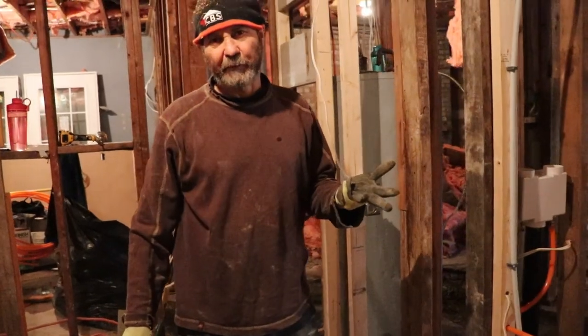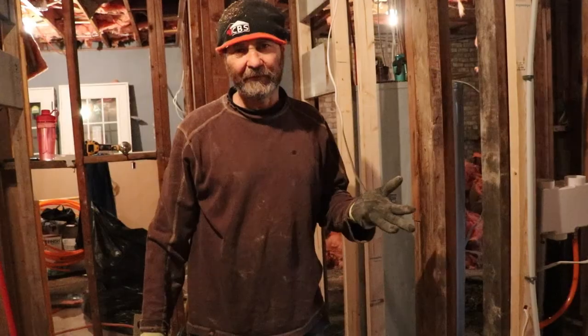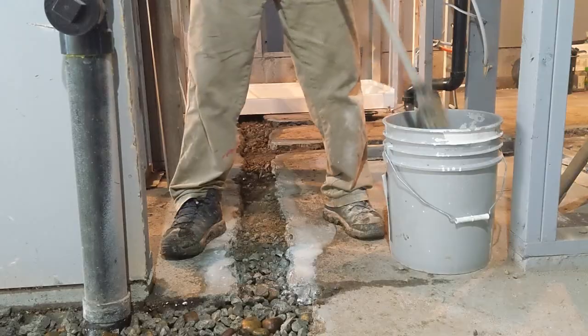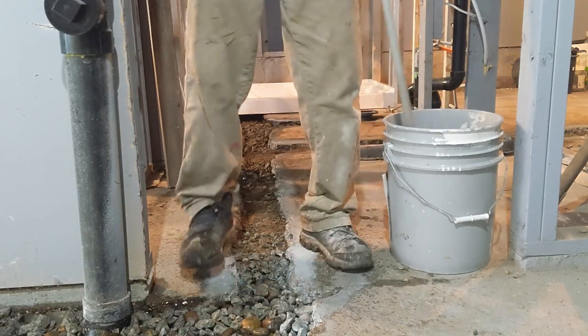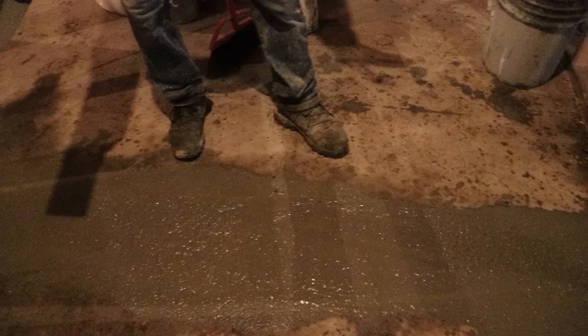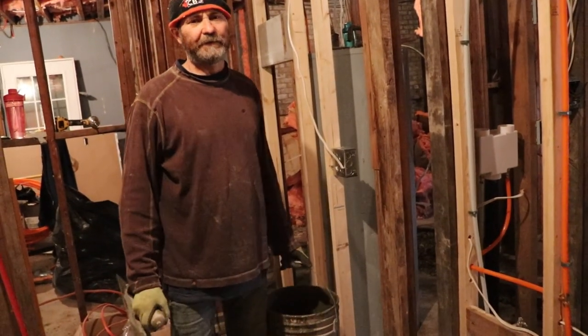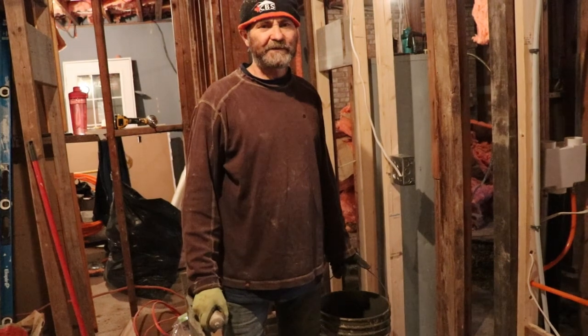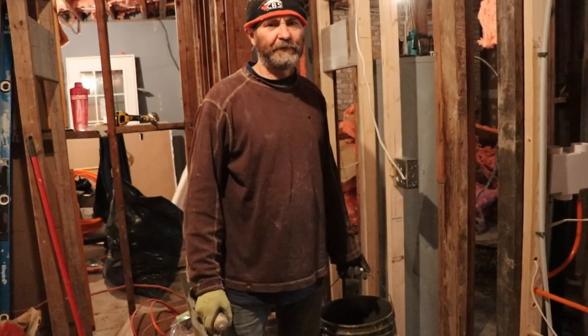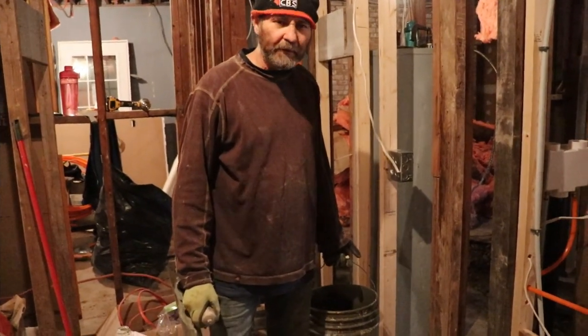It's not that much to scrape — looks pretty smooth. So first we compact it with water, we let the water run; second we just use whatever we had to compact it; and third we just use the glue to give the extra strength to the old and new concrete, then we just put in the material. When this is set I will come and smooth it up a little bit. Thank you very much guys for watching this video. If you want information about other stuff related to renovation just check my other videos. If you have a particular video you want to see, let me know. I love you guys, see you soon.